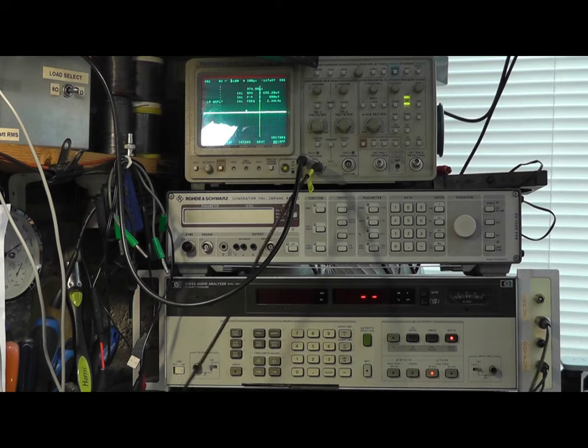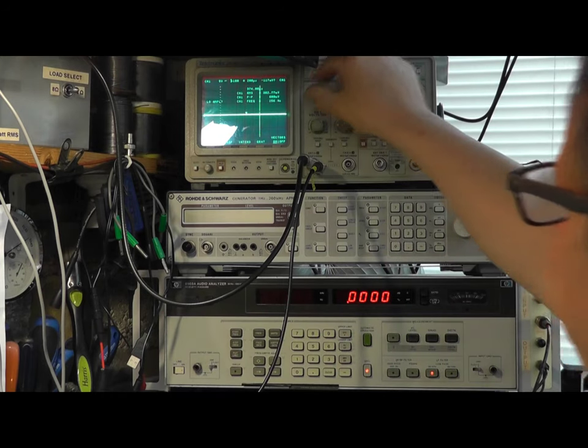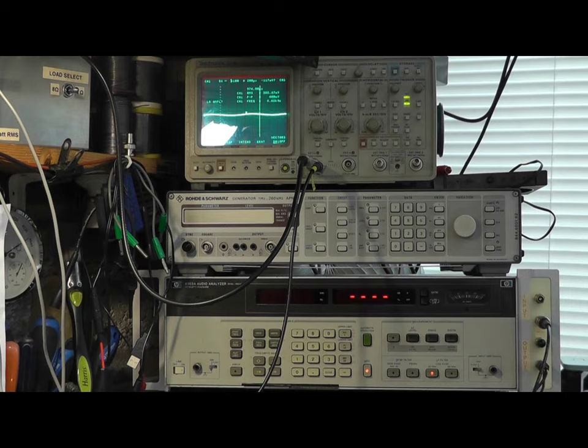So what this involves is running the amplifier up just short of clipping and looking at the power analyzer here. So I'm going to go into a special function, 19.08. Right hand meter will now display watts. Let's push the amplifier up to clipping. Okay, so it's 8.3 watts per channel, both channels driven.